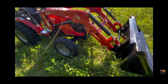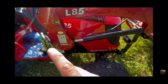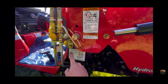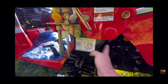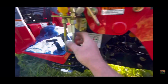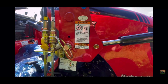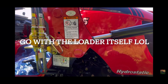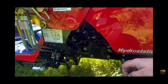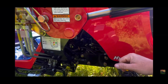Now we're on the other side of the loader. You can see the L85 here — this is what I was just telling you about. The quick disconnects are attached right here to the loader with a couple of bolts. This bottom piece actually stays with the loader frame, which is attached down here. That allows you to keep the bottom half attached to the tractor, but the top hydraulic hoses will actually go with the tractor itself. Whenever you are operating machinery you should always make sure all of your nuts and bolts are good and tight.